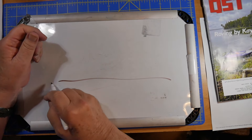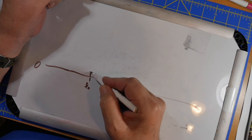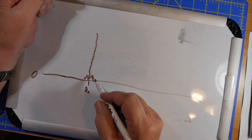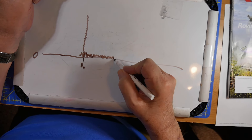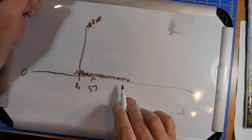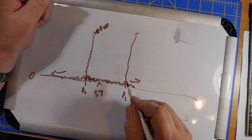If this is zero right here and this is your output, if you pick an operating frequency — we'll call it F-naught — you put out a strong signal on that, and then you've got whatever sidebands you have. Usually the carrier's not there when you're doing single sideband. But what happens is there's what's called digital noise or hash that goes out quite a bit. If this is 100 watts, this can still be like S7, which is a lot less, but it goes quite a ways outside the band. And your other receiver, at frequency F1, picks this up in its passband.